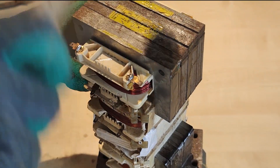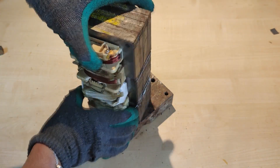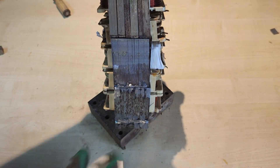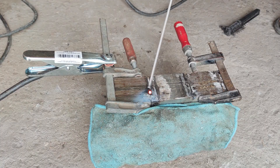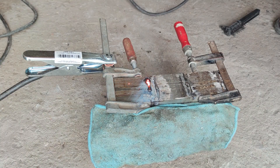Now it's time for the final two pieces of the puzzle — the side armature parts. This will complete the magnetic circuit and provide a path for the magnetic flux to circle the windings and return back to the primary coil. While having everything assembled, it is time to permanently weld the armature. Before that, I covered the windings with wet towels in order to protect them from any sparks and molten iron beads.